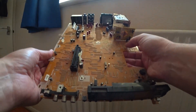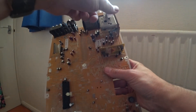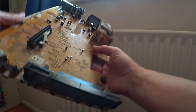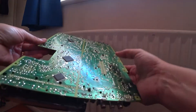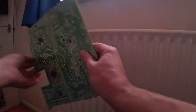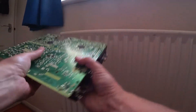I thought, well what can I do? It's got to be in this main board now. I probably should have known earlier, but there's a bit of a bend in the back here. So I decided to take this whole board out and have a look on the other side. I had a good look, did a sniff test of the main components and couldn't smell anything. But where it's taken the strain, obviously a knock at some point, it's actually broken some of the tracks.